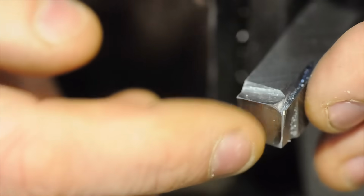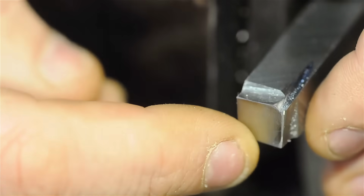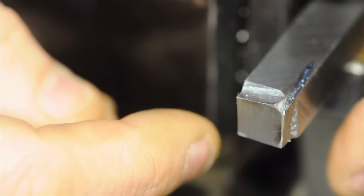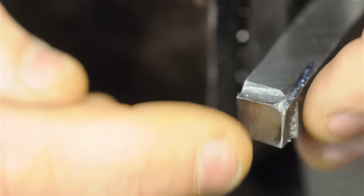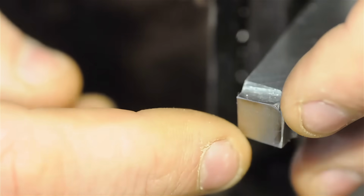I mean, that sort of basic single-tooth, single-point cutting geometry applies to everything. Lathe tools, table saws, chainsaws, cold chisels, drill bits, end mills, you name it. Just think about how you're approaching the work, how you'd like it to cut, and where you would need clearance and relief.